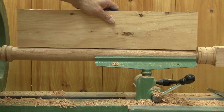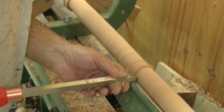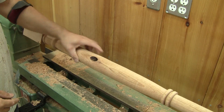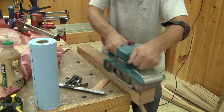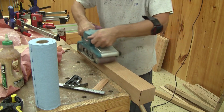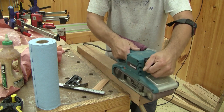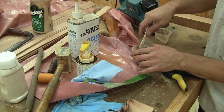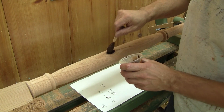I use a straight piece of wood to check if the top of the post is straight, so I know where to remove more wood. Unfortunately, the piece of cherry I used had a knot. I need to fill the hole. I want to make a wood paste, so I collect cherry dust. After a while, I have enough dust to make an epoxy mix with cherry dust. Then, I fill the hole with this paste.